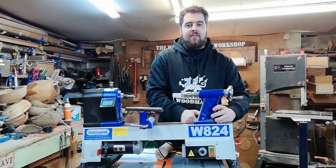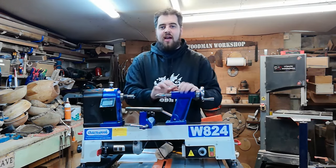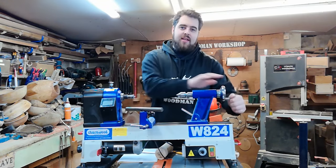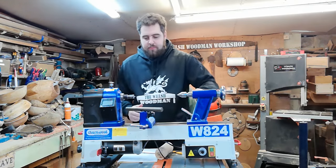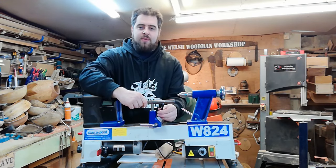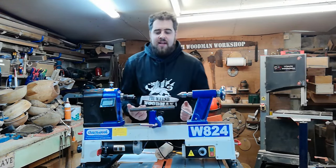On the right-hand side of the lathe you've got something called the tailstock — you can advance this up to support pieces between centres. It has locking levers on the back so it's locked in place. As part of the tailstock there's something known as the quill, which you can advance or retract by winding the wheel at the back, and the quill also has its own locking lever. In the centre we have something called the banjo, which holds the tool rest. You can raise or lower the tool rest depending on your piece.